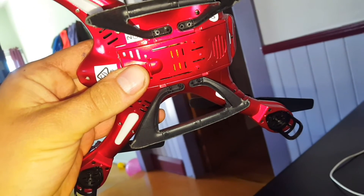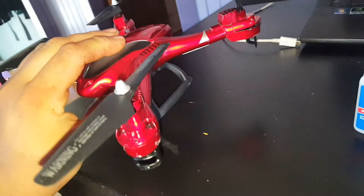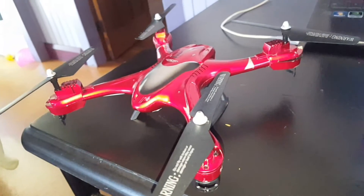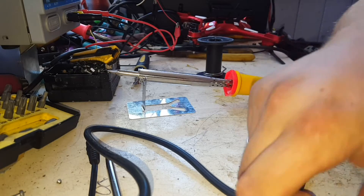Then what we're going to do is modify the battery holding capability. It's got a 650 milliamp hour LiPo in the bottom of it now. I've got a 2800 milliamp hour LiPo out of a laptop battery which we're going to have a go at. I'll glue this up now and we'll get stuck into that.